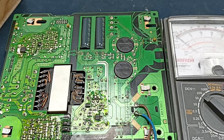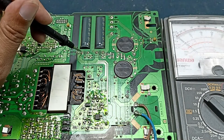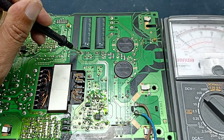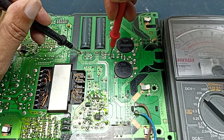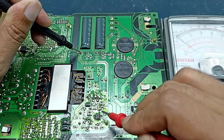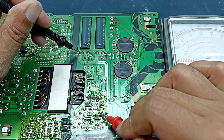Now check the input voltage after installing the new MOSFET — checking if it is still hiccuping or not. Checking IC input voltage. This one is ground, and this one is the IC input voltage. You can see this voltage is now standby — right now it is not hiccuping. Checking again — yes, this is the standby voltage and there is no hiccuping.